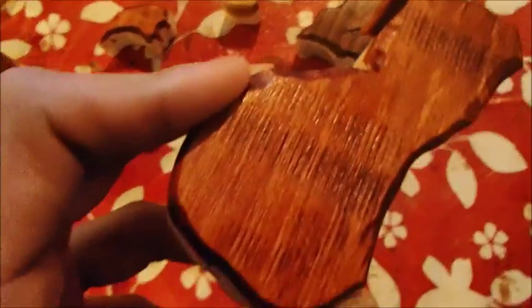That's the first layer of stains on all the pieces. I'll be back tomorrow for the second coat, so see you guys then. Hey guys, I'm back in the shop. I've applied another coat of stain and one layer of shellac. The next step to finish the pieces would be to sand off the thin layer of shellac because it leaves quite a rough finish, but then after that we're going to be applying just some clear gloss to the pieces. Let's get to that.